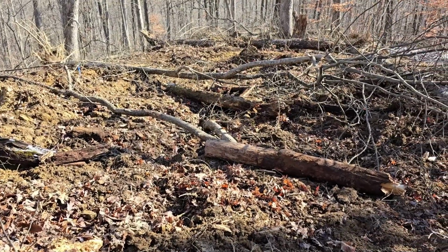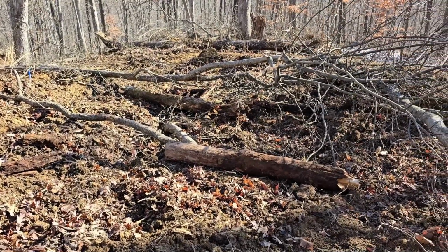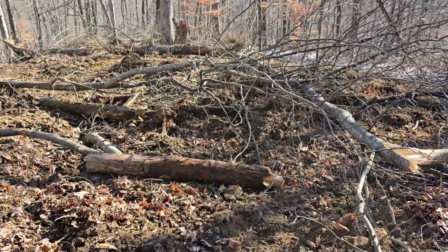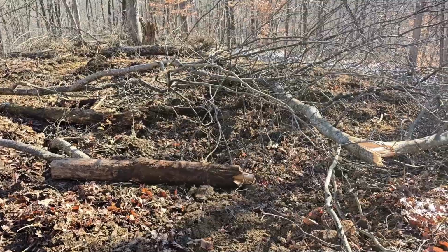The wetland basin is 12 inches deep in the middle and contains 24 inches of compacted clay. Topsoil, organics, and large woody debris have been spread within and around the wetland basin.